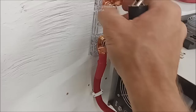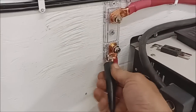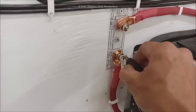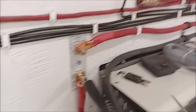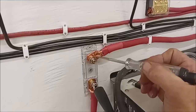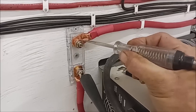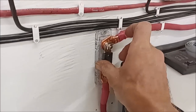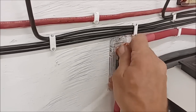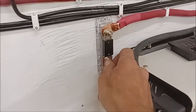I'll loosen that up and get it ready — I'll pop a fuse in as soon as I get that in there. I'm going to clamp that on. This is a 3000-watt true sine wave inverter — takes a lot of juice, but let's watch. Those capacitors are now fully charged. If I had just dropped this fuse in and swung it into place it would have been a massive arc, a huge surge of power going into this inverter, and generally it would have fried something. Now we can power the unit on.